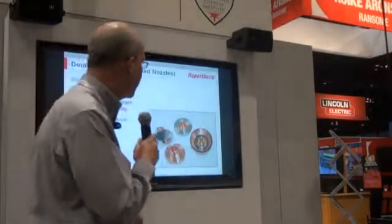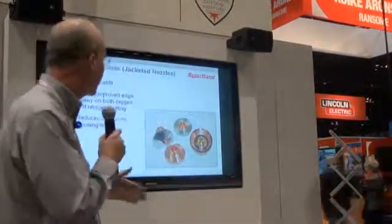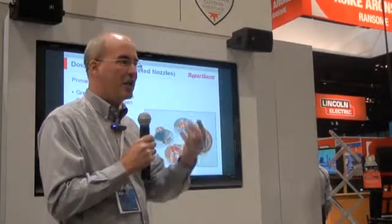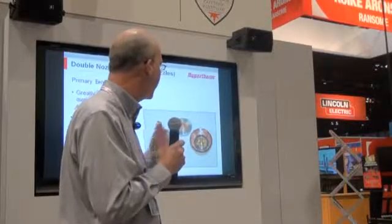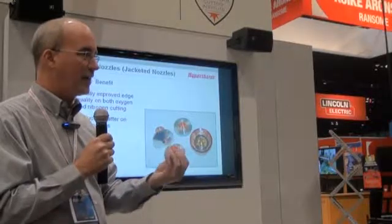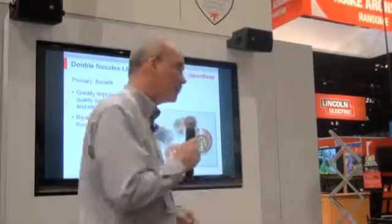Next would be a double nozzle, which is simply a nozzle pressed within another nozzle. The benefit really comes down to edge quality — the edge quality on a double nozzle is fantastic on the cut surface. By inserting one nozzle into another, it creates a null zone of laminar airflow, which is incredibly smooth. This is how we arrive at the increased cut quality and edge quality of the part. An additional benefit, discovered somewhat after the fact, is that this null zone at the exit of the nozzle orifice also helps prevent back spatter from coming back onto the lens, thus increasing lens life as well.